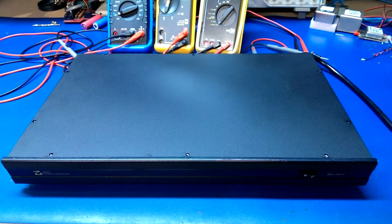So that's it. I'm going to replace those MOVs, screw it back together, and it's good to go. I'm going to use this in a small stereo cabinet with a couple of components — nothing high power, just as a simple surge protector slash power strip. I hate cheap plastic surge protectors — those things are garbage. This nice quality rack-mount steel chassis unit with high-quality plugs, decent EMI filtering works great for my purposes, especially for having nothing wrong with it and getting it for $10. Thanks for watching.